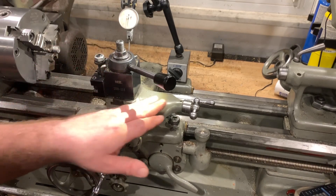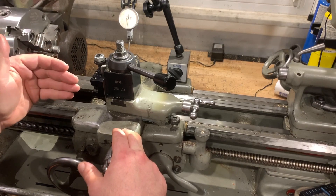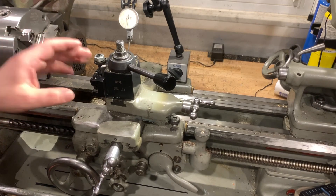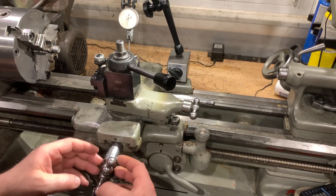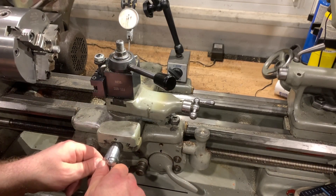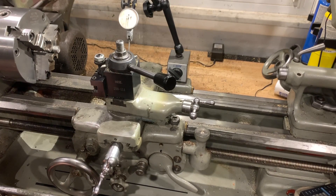Here's a little explanation of the compound five and a half degree trick. The problem is when you're trying to bore a bearing pocket for a top, you have to hit the number very precisely — we're talking about press fits of like three ten-thousandths of an inch up to like 1.2 thou. The dial on your cross slide only measures in thousandths of an inch, and on my South Bend 9a the graduations are very very small, so being accurate between those marks is really quite difficult and you're usually going to overshoot.